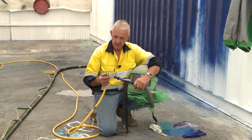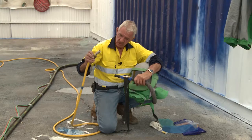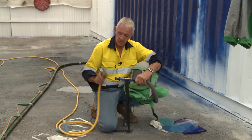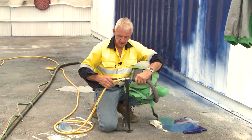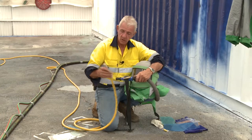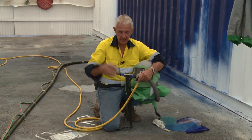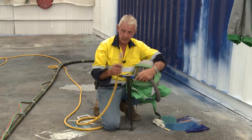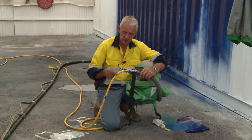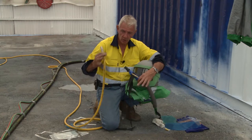These particular fittings are spring-loaded and they have a particular ferrule to suit that fitting — it's not a common fitting. This yellow line is for breathing air only. It has a unique ferrule-based fitting to marry with this particular fitting with a spring-loaded lock. The reason we make them like that is so you can't plug your spray gun in there and use it for an alternate purpose, because this is designed to have the Radex filter on it. If you take this hose and plug it straight into the compressor, you can contaminate the internal wall of this hose. When unawares you plug it back in after someone's used it for spray painting, you expose yourself to any contaminants pushed into that line from alternate air. So this goes with this, goes with the Radex — they all marry up together.